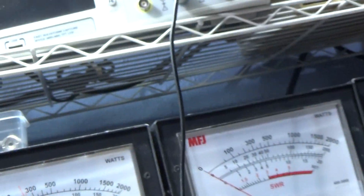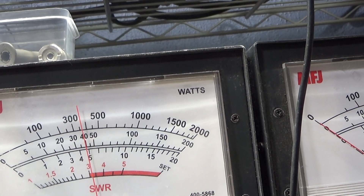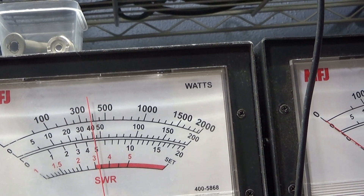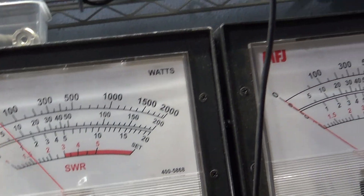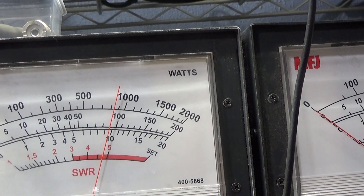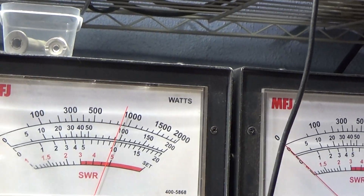Back to plate voltage — now we're going to key it down with drive applied. The watt meter is only showing about 230, but that's because it won't catch peaks well on an average meter. On this meter set to RMS, calibrated to a Bird, we're doing about 100 watts average audio. On a higher range, we're talking about 450 watts average. Switching to peak, we're seeing about 900 watts peak.